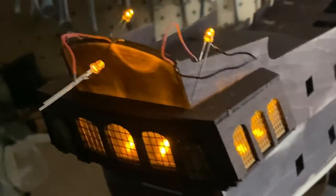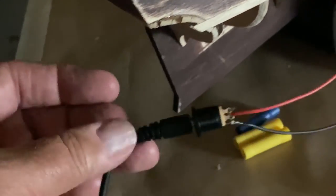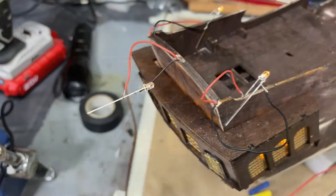I'm also happy with my choice not to use a battery. I'm going to insert a little plug-in device and run off AC. What I purchased was an adapter through Amazon — instead of nine volts, it puts out three or three and a half volts. I think that's a better system to use with these LED lights, and I did put resistors on all of the LEDs.